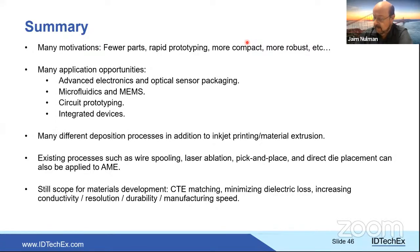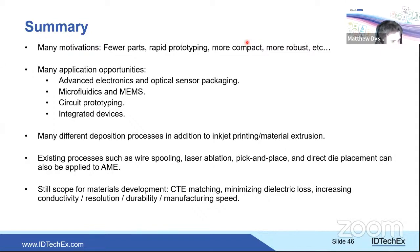Third question from the US West Coast: how do you solder vertically stacked ICs? Matthew explains that within AME the approach is to 3D-print a fan-out array with via-like structures printed upward, then print a dielectric layer and place the next chip on top — printing the associated wiring around each chip. Conductive adhesives with line/space ratios down to ~10 microns are also an option. Conventional soldering is possible but temperature compatibility with the dielectric can be a challenge.